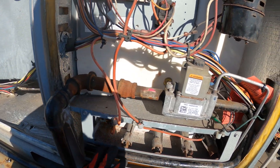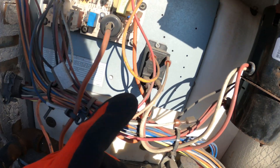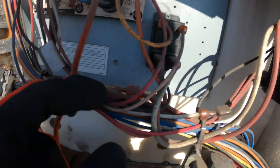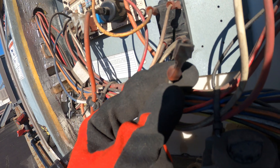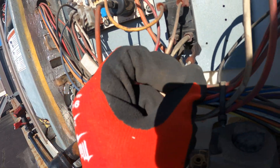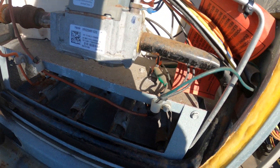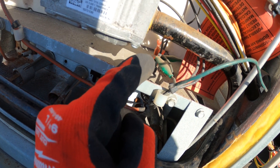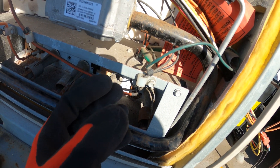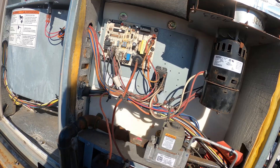We're going to focus today on the sequence of operation, but I want to point out something I noticed right off the bat. I'm looking at this relay and down there I can see the thing burnt off, and a piece of the contact from that relay is in this Stacon — this thing burnt up. Please never do this and do not work on this type of equipment if you're not a professional. There's a jumper wire on the rollout switch. That means the flame came out of here and shut this down, and it shut it down for a reason — that is not something to play with.